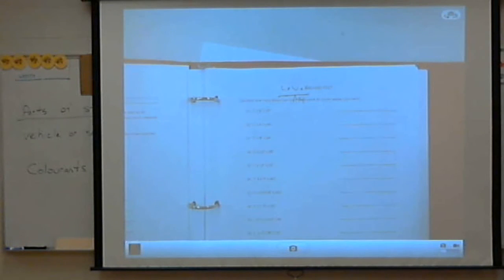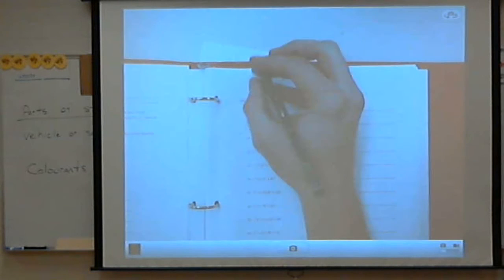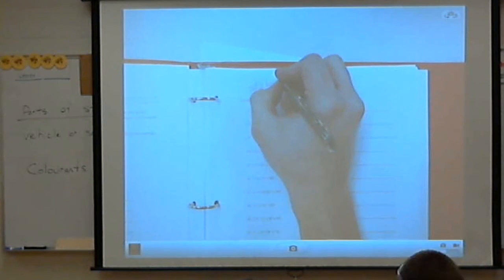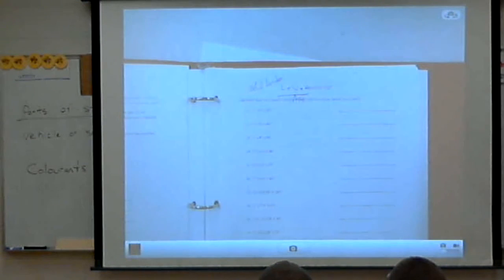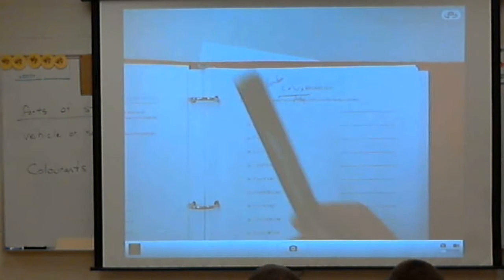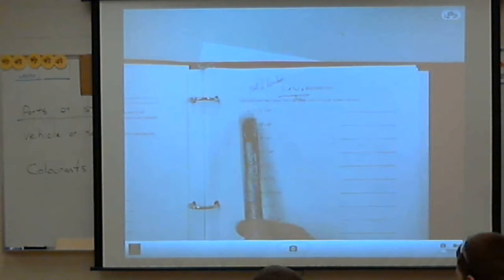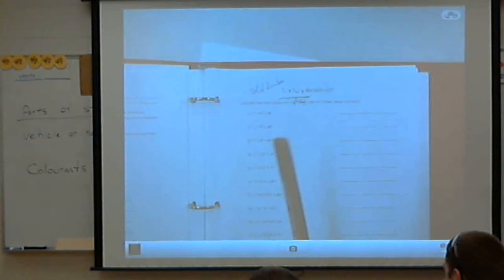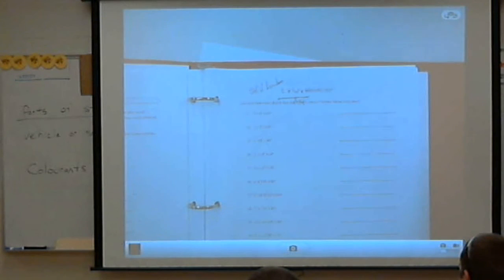And this is only for solid lumber. We don't use this for plywood or for trim at all. Solid lumber is length times width times height, because we deal with the thickness of a board, the width of a board, and the length of a board. With plywood, once we start getting into that, we only deal with width and length. We don't deal with thickness at all, okay?